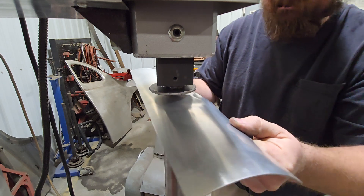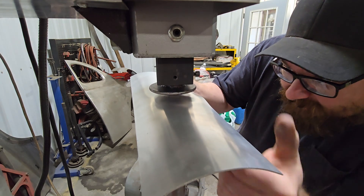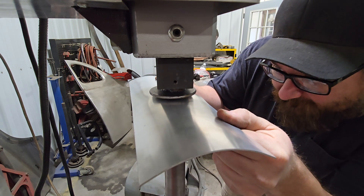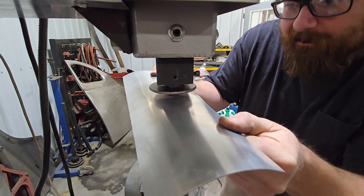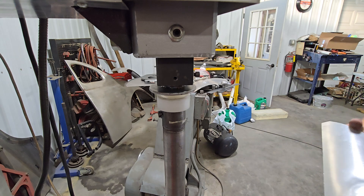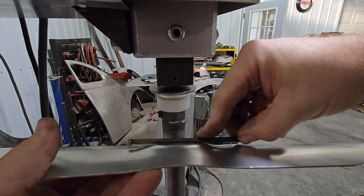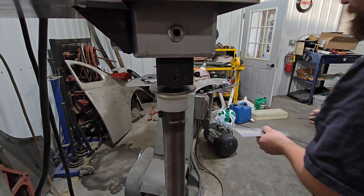I can run this machine faster, but I don't want it to look like magic. I want you guys to understand that that high spot is collapsing and shoving into itself. Now look how large that flat spot is — it grew about an inch. From where we were to that, and we'll take him down the rest of the way.